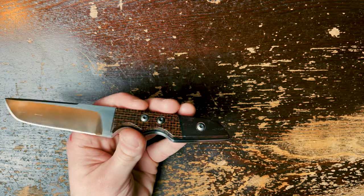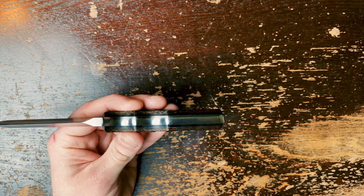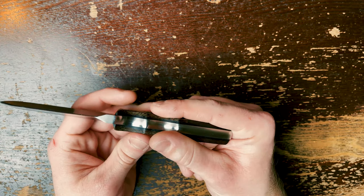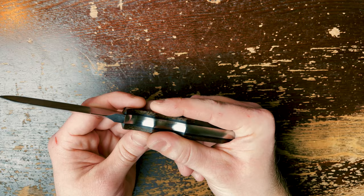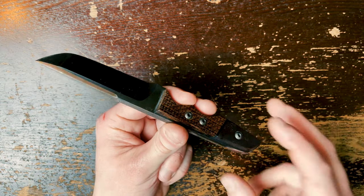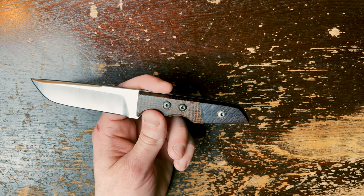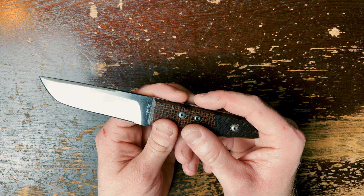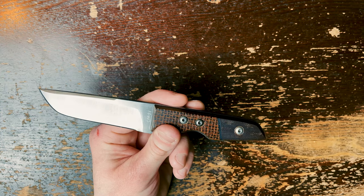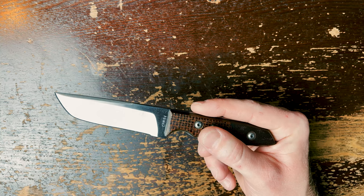And because this blade is so massively thick, Doug's hollow grind is critical. Approaching the edge, the blade is plenty thick, but not so thick that you have no slicing performance. And yeah, with the weight, this knife definitely wants to be a chopper, but it slices better than you'd think when appropriately sharp, cutting the right material, of course, but that goes for any knife. The less steep angle on the edge makes it harder to roll the edge, but you also can't touch it up with leather as easily for the same reason. It's all a trade-off. Earlier I mentioned that the angle of the edge isn't completely uniform.